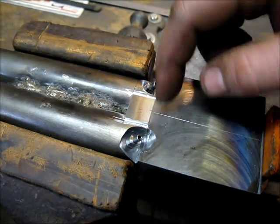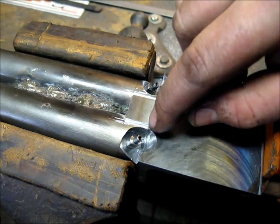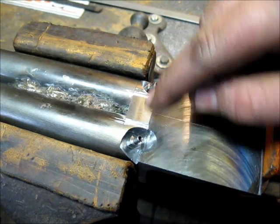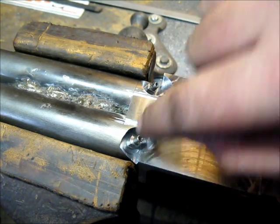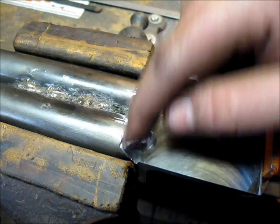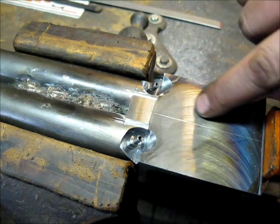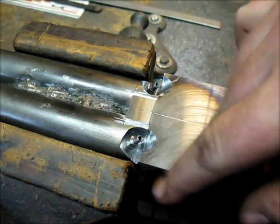So you can see I've got my fences cut here, or the inside of them anyways, and I drilled and tapped for my nipples, and I also drilled the flash channel into the recessed chamber on this. So now I'm going to start doing the layout for the top cuts on the tang and getting it shaped down.